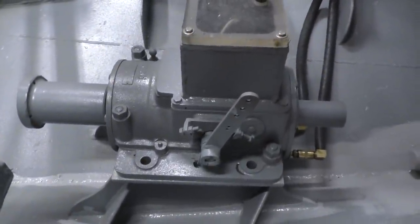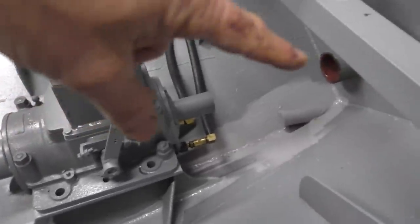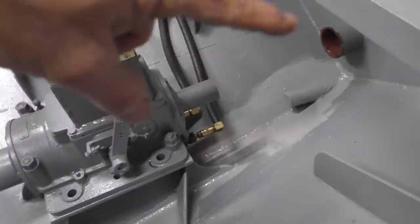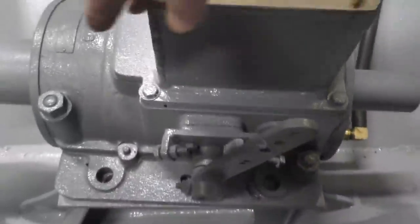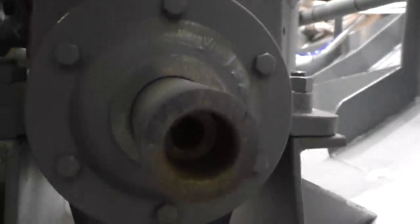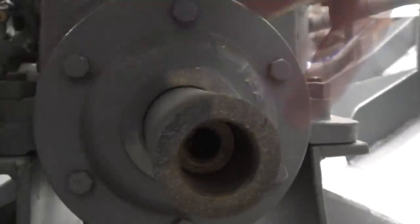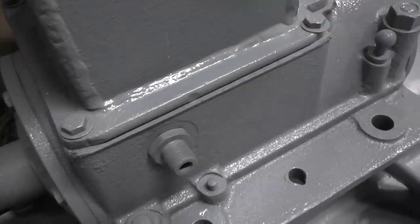Inside the boat is where this gadget down here sits. That's our Hundested variable pitch control unit. Drive shaft attaches to this end. Propeller shaft comes through the shaft log, attaches there. A push-pull cable will attach to there, and it changes where that brass fitting down there rides along, and that changes where oil is either put on this side or this side of a big piston that's right there. And when that piston moves, that inside shaft there moves, and that changes the propeller. The hydraulic oil that'll be supplied to it will just come off the power steering pump on the engine. So whenever the engine's running, the Hundested will have oil supplied to it.